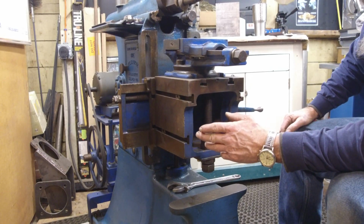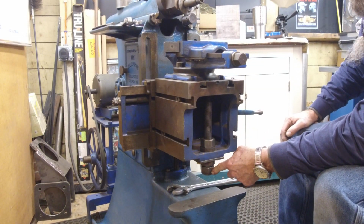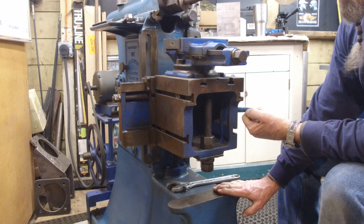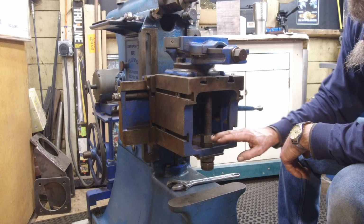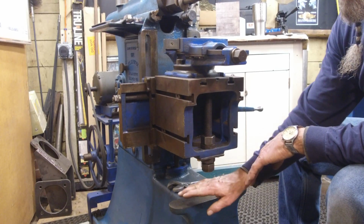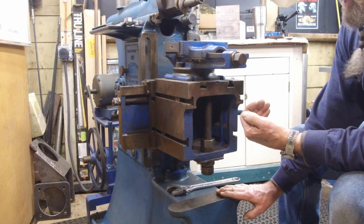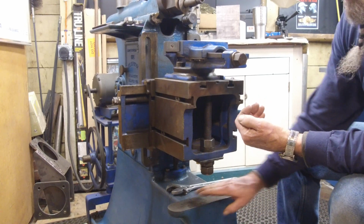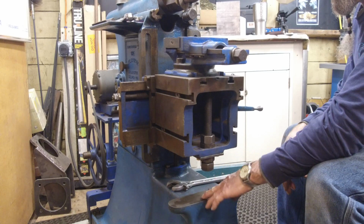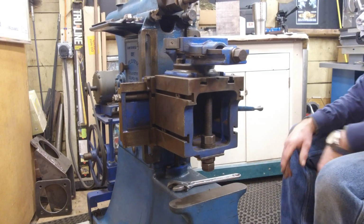One thing that's nice is it's just a 1-inch thread, and you can use the same nuts in this piece here. So basically, it's just going to be another rod with a nut welded to the bottom and then faced off parallel with the surface, because you need to support your knee when that load comes across. You support your knee on here. So once you set your table at different heights, you lock it down to the machine, and then this takes the load. When you're coming off this end of your cut on the travel, your load is coming down onto this foot. And of course it wants to slide as well, so that's why this is machine parallel flat to your travel surface. So you bring this on down and you just barely get yourself your support so that you can slide freely, but it holds the support. It's just a rest. It's just a knee rest.